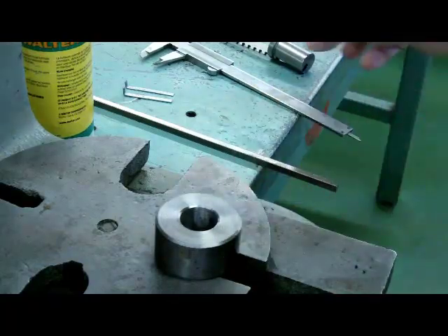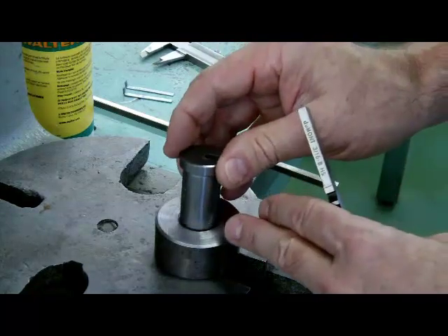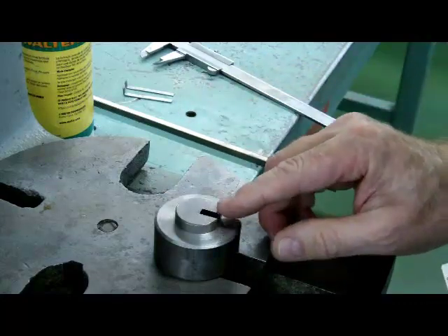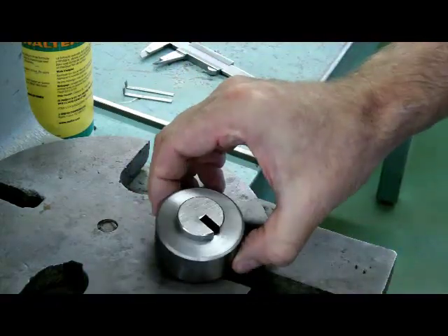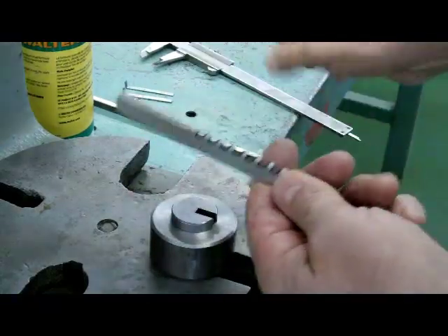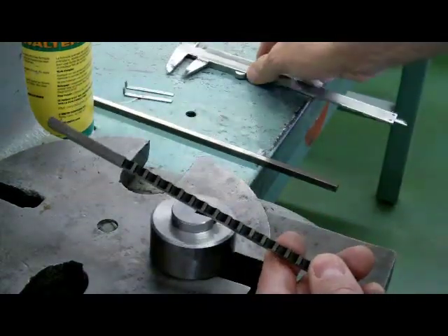What we're going to do is push this keyway into this bore, and we're going to use a broaching kit. In order to use this broaching kit, we have to have a hole that goes through it. I'm going to take a bushing and set it down inside — the diameter of the bushing is very close to the diameter we need in the bore of this sleeve. I looked in the machinery handbook and found the right size broach we need, and this is it here — this is a three-sixteenths broach.